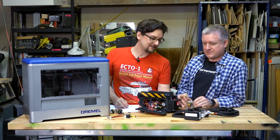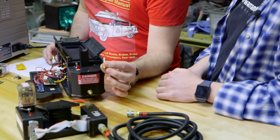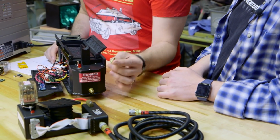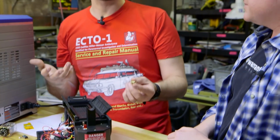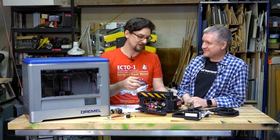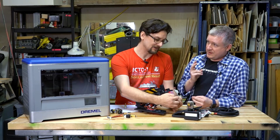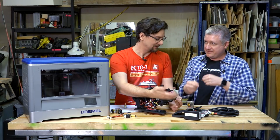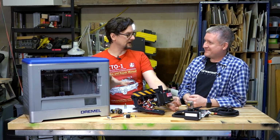So this is the Foster connector, which is a brass pneumatic connector. This is the male. So if you ran wire through this into the hose, there'd be no way to disconnect it. So we had to figure out a way to make this be able to disconnect and still have a contact. So after a lot of messing around, I 3D printed an insert. 2 contacts, because it has to complete a circuit. 3D printed an insert and then put a brass rod in it, which made it a 2-conductor contact.